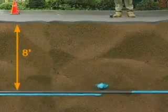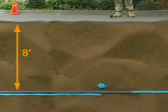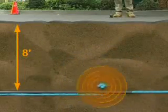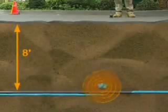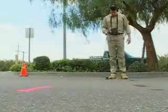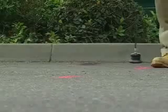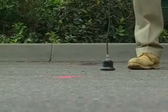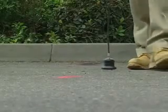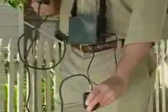Water leaks from larger pipes transmit less sound and at lower frequencies than smaller pipes. And of course, the deeper the pipe, the harder it is to find the leak. For fine leaks in lines buried deeper than 8 feet, increase the water pressure to amplify the sound. The surface material also affects the amplification of leak noises. A hard surface like concrete will resonate with the sound of a leak for 5 to 10 feet around the water pipe, while grass and earth do not amplify leak noise. Select the proper sensor for the surface on which you're locating.